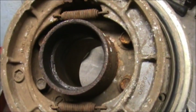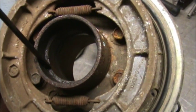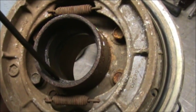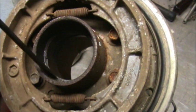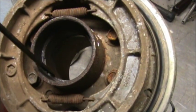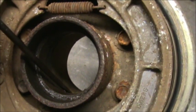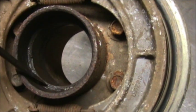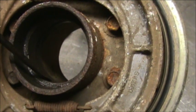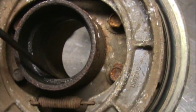When you put the bearings in, you'll notice right here there's a lip. That's to keep the bearing from going too far in, so there's no danger in pushing the bearing too far because this lip will stop it. Same on the other side when you're pushing the bearing in from the back — there's a lip there also. You cannot push the bearing too far in, and this middle piece here is where the spacer or race will go in between the bearings.